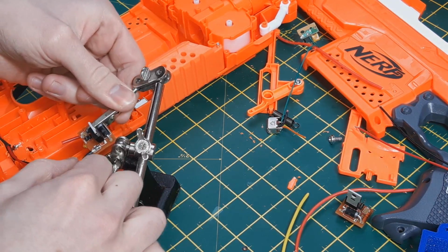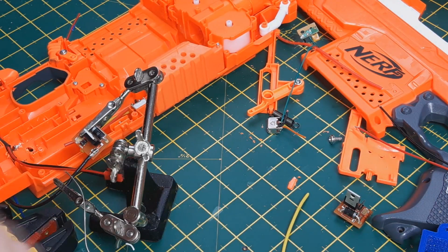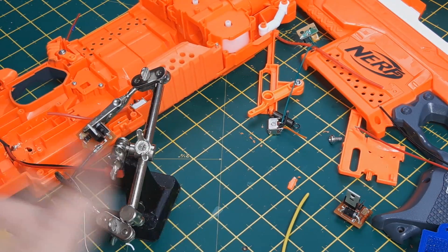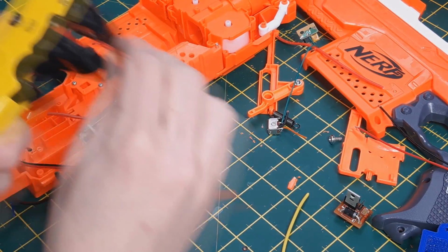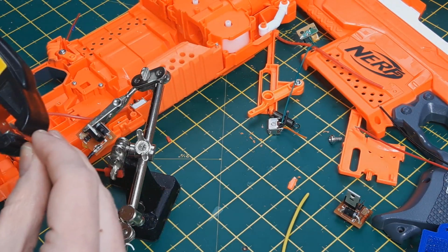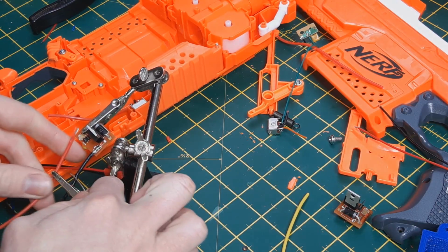Right, and then finally, if we leave that one there, then finally we need a short length of red wire. Now you have to remember that this does not go directly to this wire here. Okay, you have to get the battery in somehow. So if you take your cutters and quickly strip off again 5mm or so off the end, pop it in the grips.